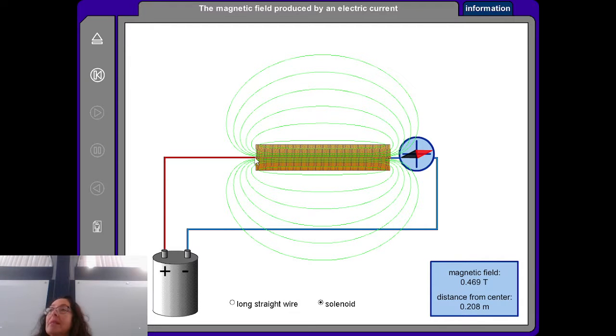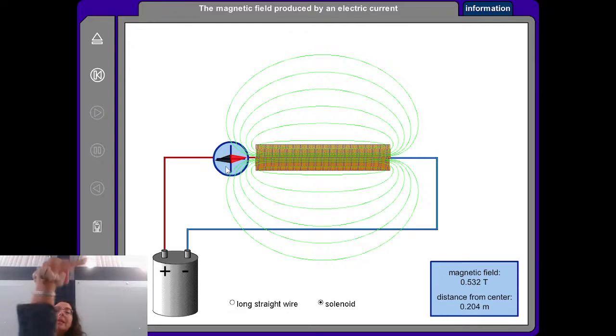If you put a screwdriver inside or if you put a core, what you are doing is those magnetic fields here that are just losing the energy of the battery in space, you bring all those lines inside your core, which is a piece of iron or soft iron that you shove in that will be magnetized, and the magnetic field will be amplified. So depending which way the current spins, for example here you see that here is the north because it's attracted by the south here, and that will be the north. So that means the current is spinning this way, which makes sense, right? So it's spinning in this direction,